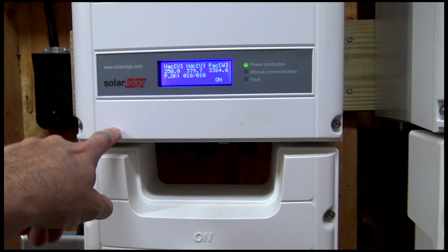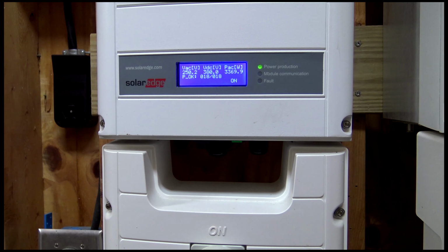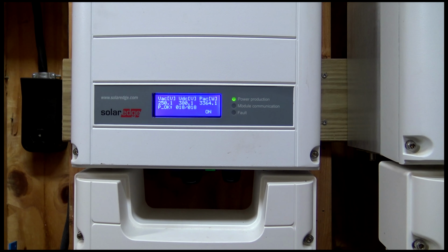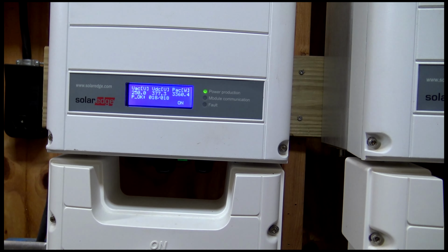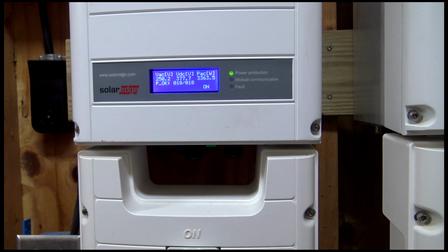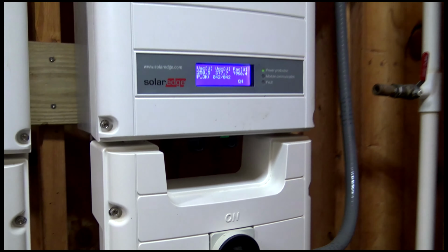This is a 6 kilowatt inverter, and I know that this one will not go above 6 kilowatts, more than just a few watts. And if you have more solar panel power supplied than 6,000 watts, it'll adjust the MPP to keep it floating right at 6,000. It'll just bounce around right there, kind of reducing the efficiency of the solar panels. So I thought that the same would happen with this 11.4 one.